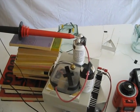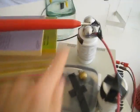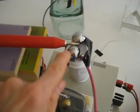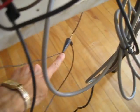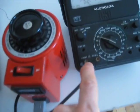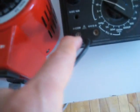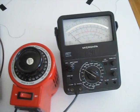Here it is connected up to a circuit for measuring the voltage going to my lifter right here. I simply have the probe tip in contact with the high voltage positive end of the circuit which is coming from the power supply. And here's the ground clip — that one simply goes to that common ground point right down there, which is a ground for the power supply. And then the other cable with the two banana plugs, the positive and the ground in common, go into my analog multimeter.